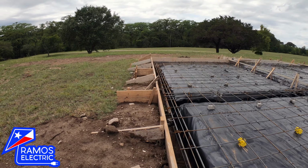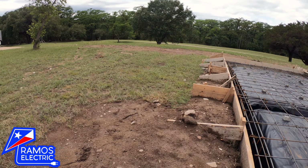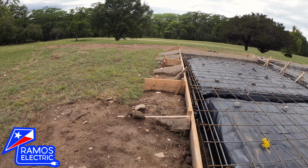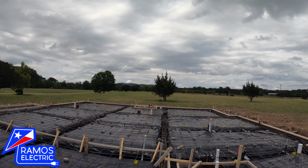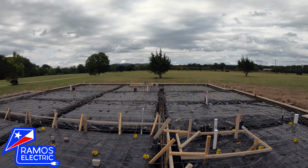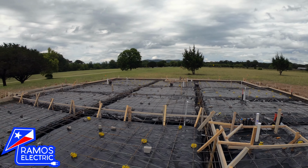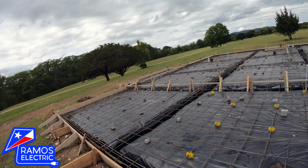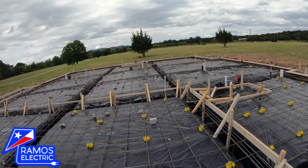Now in this one, it was engineered and approved that it's actually just above natural grade on this little plateau we're on. Usually with the hill country, you can see the hills all around us, we have all these beam trenches in rock, or they bring in fill that's compacted and they trench through those, and that becomes foundation to the home or structure. So this one was very soft.